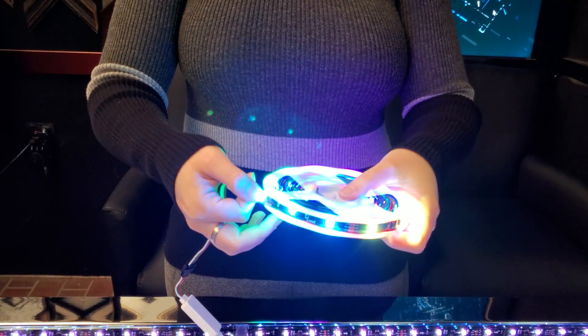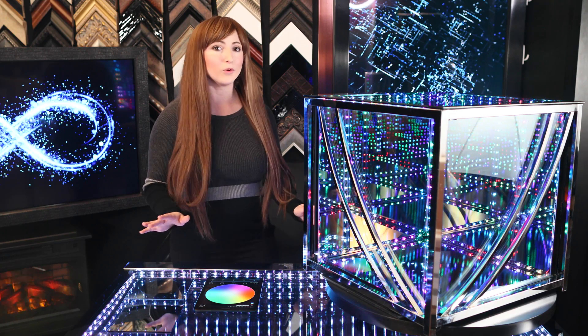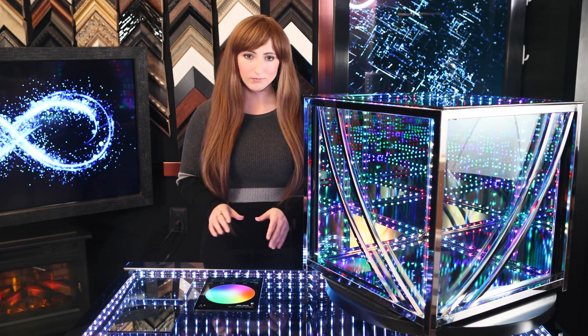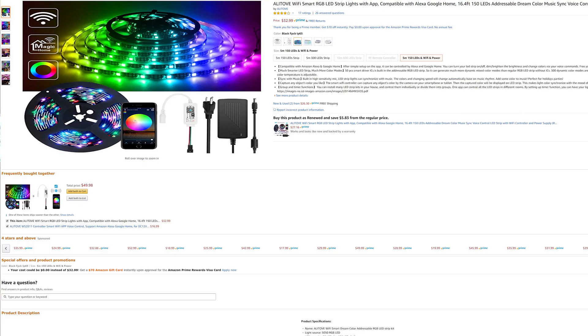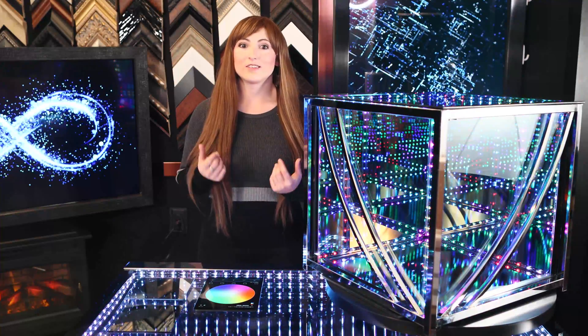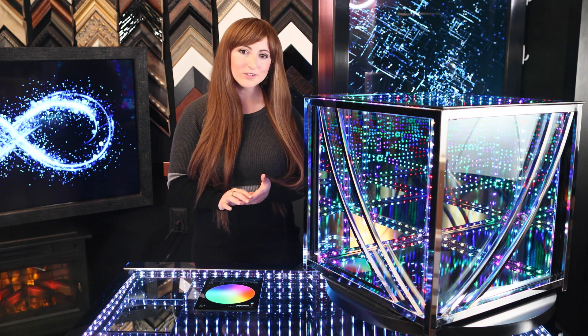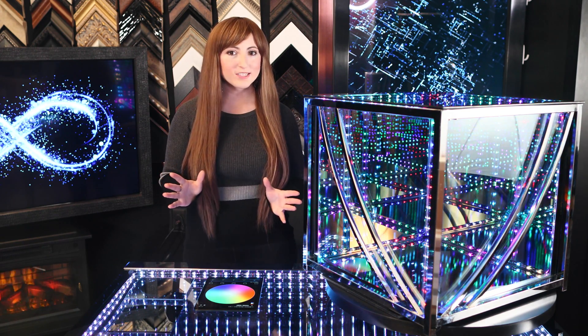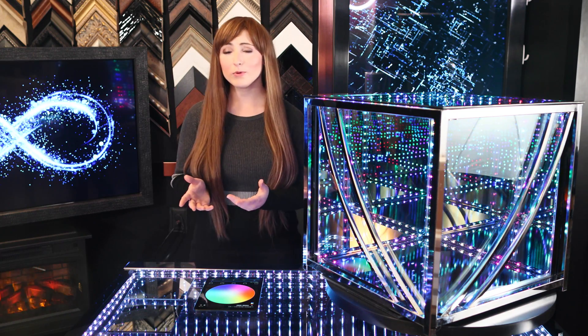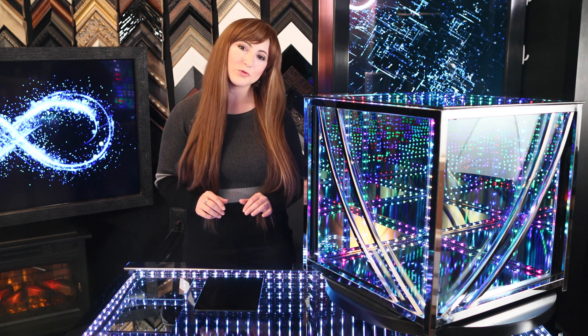What type of LEDs should I use? For the LED light strip, I recommend using a bright one, at least 12 volts — 5-volt strips tend to be way too dim. You'll want an LED strip that supports individually addressable LEDs. This will allow you to truly customize your cube: make kaleidoscope effects or a slow meditative trance. Pick your favorite colors and get creative. The controller works hand in hand with the strip, so you'll need one that's compatible and connects to your phone with Wi-Fi or Bluetooth. I'll leave links to the parts in the description below.